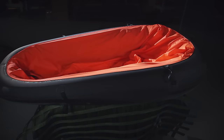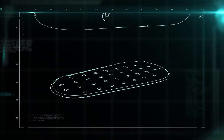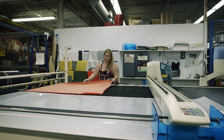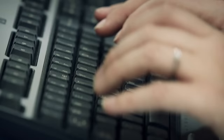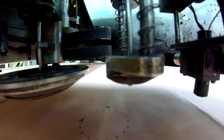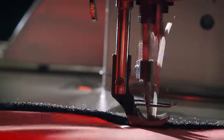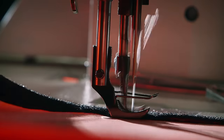The single person life raft is designed to be stowed in the cockpit of fighter planes. If the pilot ejects over open water, the life raft goes with him. The single person life raft can be broken down into three parts: the hull, the floor, and the canopy. Sheets of bright orange fabric are rolled out — the color has been chosen so the canopy can easily be seen from the sky. Guided by a computer-generated stencil, the electronic cutting station tracks the program measurements, marks the pattern on the fabric, and cuts it out. At the sewing station, velcro trim is attached to the edge so it can be closed around the body. Velcro is flexible and can withstand the high-pressure vacuum packing required for the ejection seat — a zipper would get crushed.